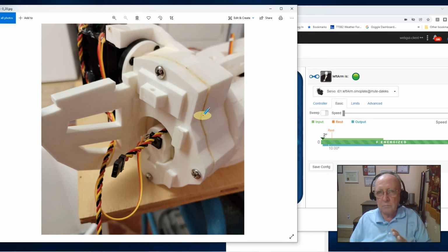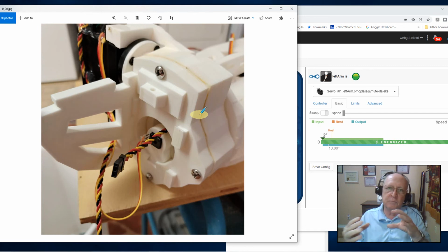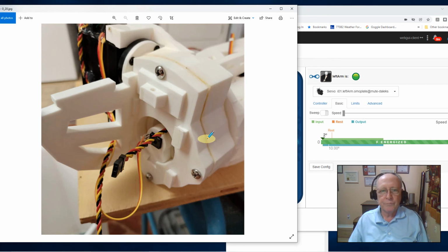Now, I'm going to take us down a little bit of a rabbit trail here, just a small one. Right now I have a temporary screw in here. The reason for this temporary screw is that it's helping to hold the alignment for my ball bearings. It's the ones that we screw up and down for the tension on the ball bearings. And again, there's no torque ratio or anything given. It's by guess and by golly and how smooth everything's running. You think it's too tight, loosen them. Too loose, tighten them. It's by gut feel. So I'll have to take that out during my final assembly.